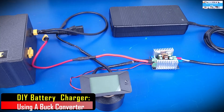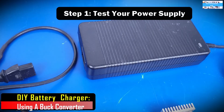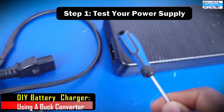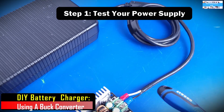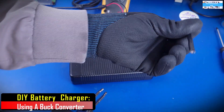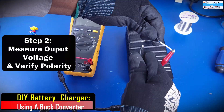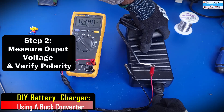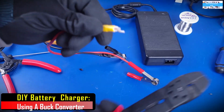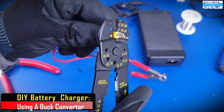What we have here now is the test setup. Before we use it to recharge some batteries, I'd like to walk you through some steps I take to make sure I'm doing everything safely. The first thing I usually do is test the power supply. As you can see, this is the AC input and this is the DC output cable. What I will do is cut this cable, since I'm no longer using this power supply for a computer. This allows me to measure the output voltage to confirm it matches what I expect, and also to verify the polarity — the white wire is positive and the black is negative. Then I'll put some ring lugs on it to make it easier to connect to the DC to DC buck converter.